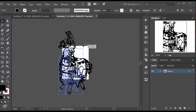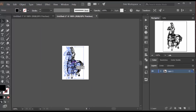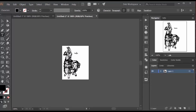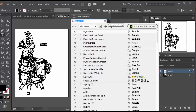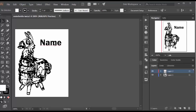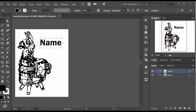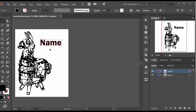I create a new drawing that's exactly the size of the engraving I want to do — 100 millimeters by 80 millimeters. I size it, place it where I want it, and then start to add the text. You can open the character window, pick a font that looks good with Fortnite, and size it exactly the way you want. The very last thing you do is go to Type, Create Outlines, and that turns it from a font into a drawing.